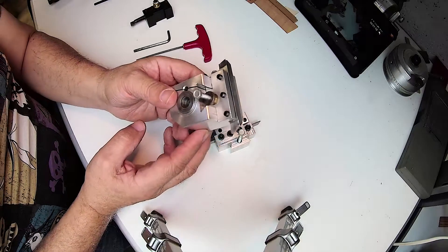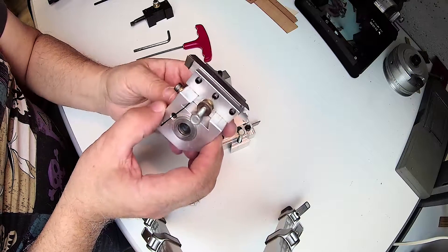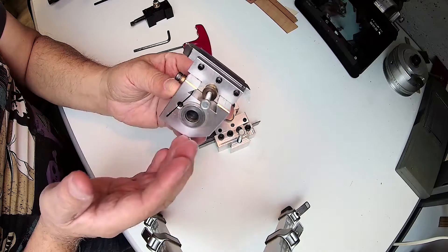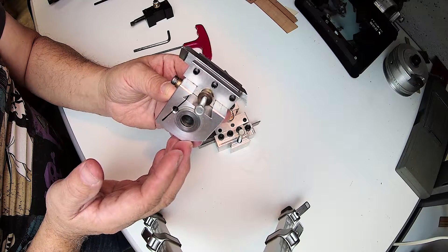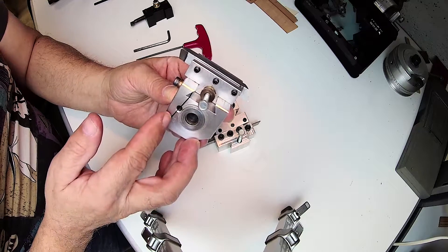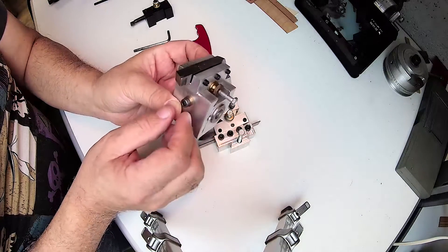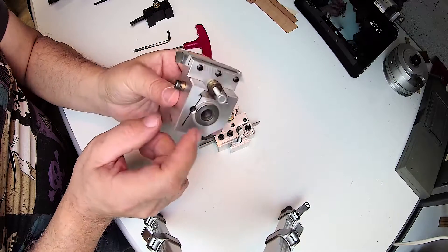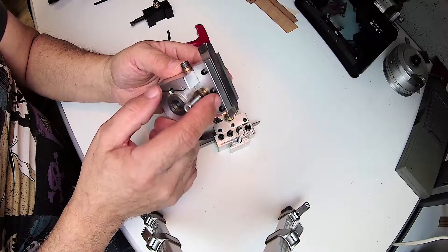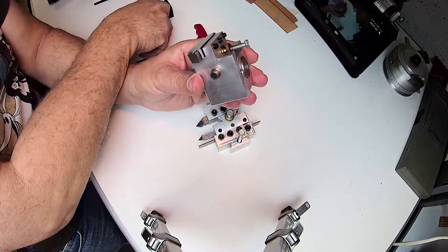You can see it is made out of steel scrap that I found at my local scrap yard. I went ahead and milled the dovetail with a dovetail cutter — it took many passes as little milling machines really cannot create very deep cuts. I used a slitting blade to cut this slit here, which aids with this screw to act as a clamp against the male dovetail that the actual holders feature.